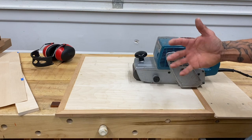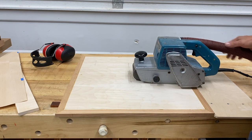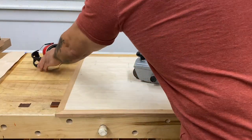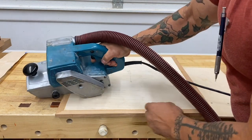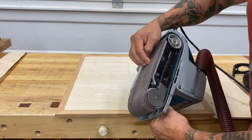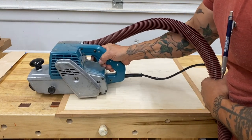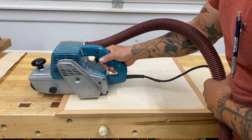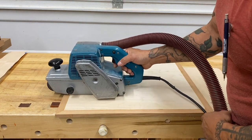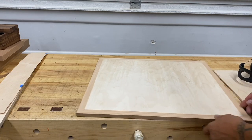The cherry is slightly sticking up and I need to get it flush, so to accommodate that we'll position the pressure of the belt sander appropriately. When I'm sanding this edge, I want the center of the pad — what I'd call the balance point — applying pressure right on that solid cherry. I should be right at that tip and pulled back slightly, so I'm not putting any pressure where the back roller could dig in. If I'm too far forward, the back of the belt will also dig in, so I need to be right there.